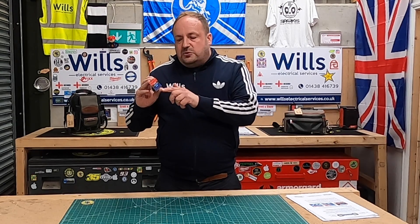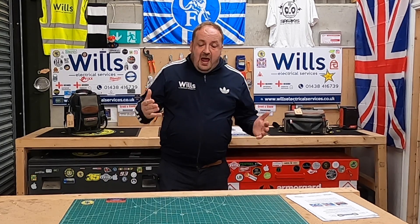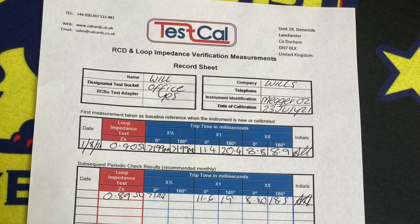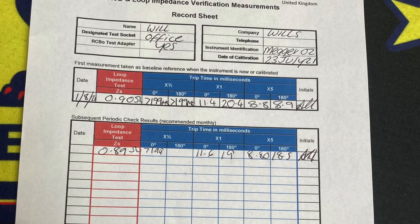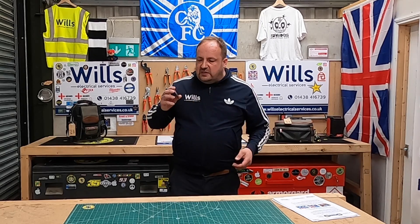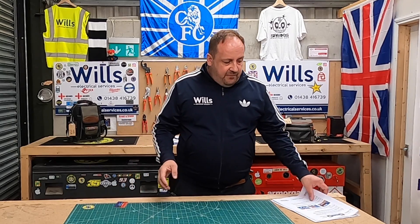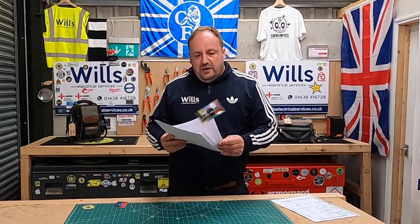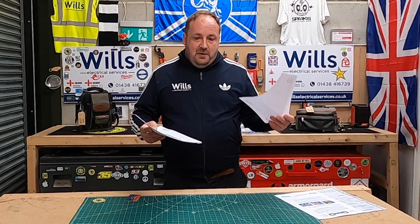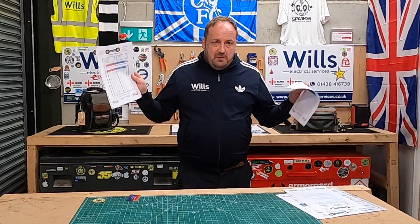It becomes clearer once you come up and do it. What I got stung for last time during my assessment is the RCD — I never used to keep a record of the RCD and the earth loop impedance, which I thought was a bit weird. One of the good things is that if you go onto the cal card's actual website — I'll put the link below — all of this is free to download. You've got the instructions on how to use the cal card, plus the acceptance test procedure for confirming RCD and loop impedance, which is the one I got a bit rinsed for.